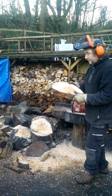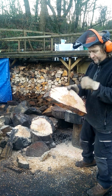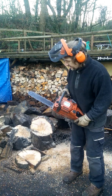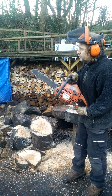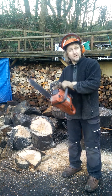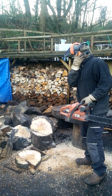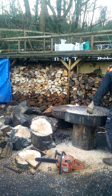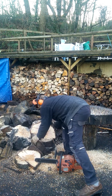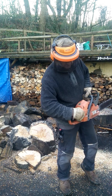Hey guys, so first cut, that's running on some, I presume that's about 18 inch timber across, very, very hard. Cuts okay. Let's see, whoever sharpened the chain previously has probably taken the rakers down a little bit low. So it's a little bit aggressive cutting, but certainly seems to cut really well. I'll do a second cut with it. Okay, kill switch, throttle lock.